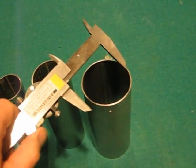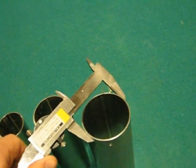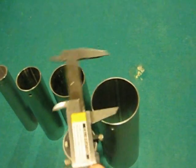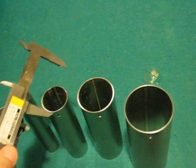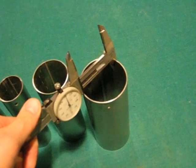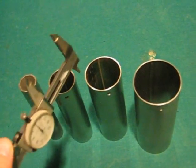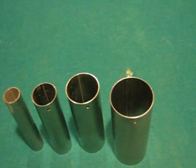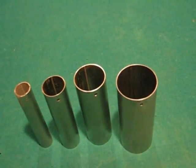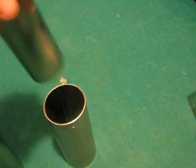It's important that you measure the outside diameter and take an average — go all the way around and measure it a few times. Write down the outside diameter for each pipe, and then the inside diameter for each pipe, except the last one. Then take the difference between the two to find the spacing you need between each pipe, so you know what size to make your spacers.